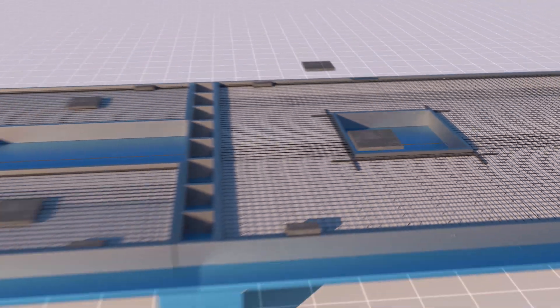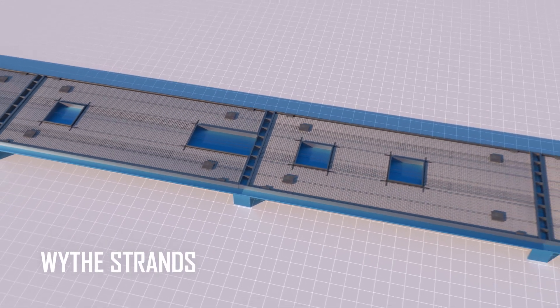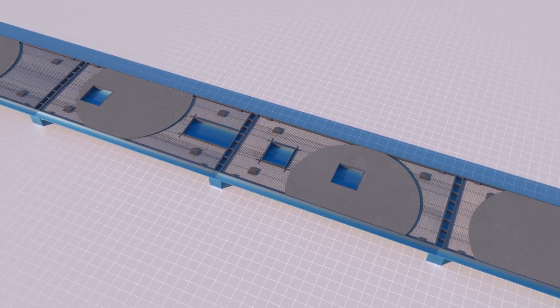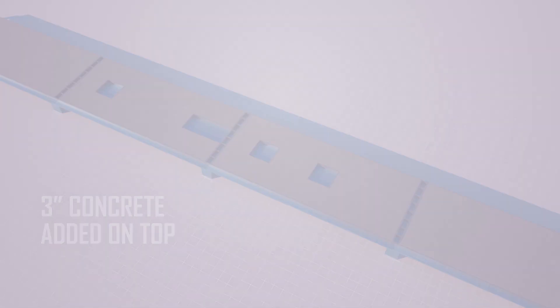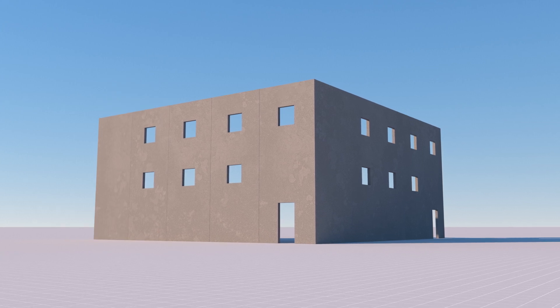Pick points and embed plates are inserted easily, followed by running the top wythe pretension strands, and then finishing with the symmetrical 3 inches of top wythe concrete. You have now created a fully composite insulated precast panel in one pour.